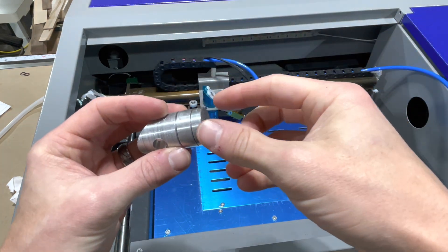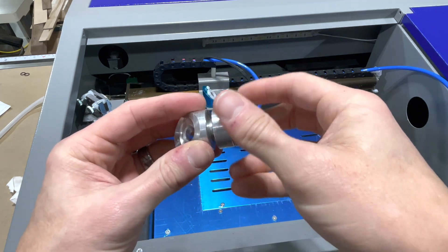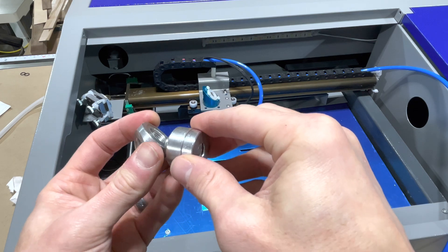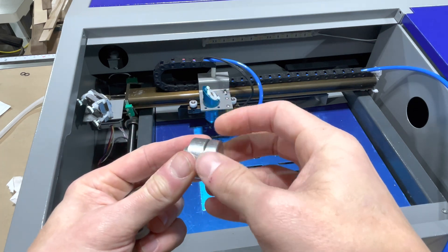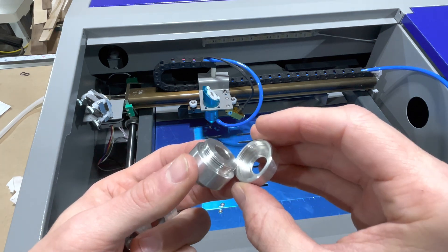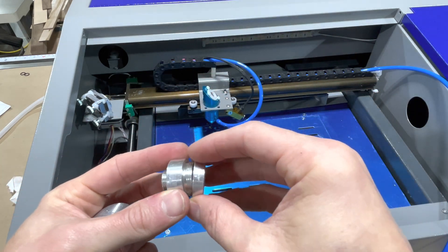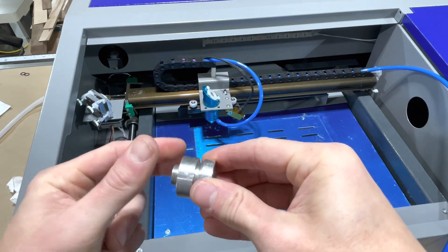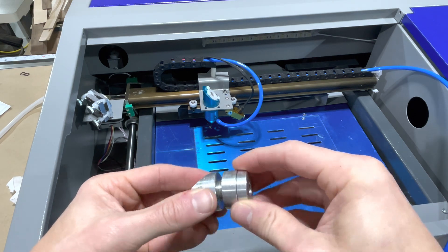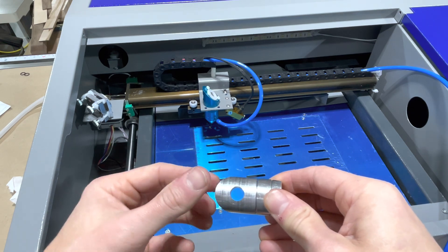Before jumping to the other side, let's look at the old laser head — not very impressed with the quality or fit and finish. The rest of the machine is great; I love that Monport is leading the industry by including a board that accepts LightBurn. But to really lead the K40 industry one more step, I think they need to include a head that accepts air assist right out of the box. They're already the first company to work with LightBurn out of the box for a small K40, and adding a plug-and-play air assist option would really make them stand out.